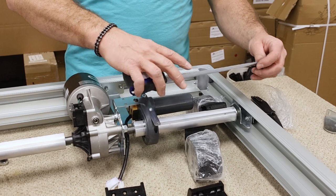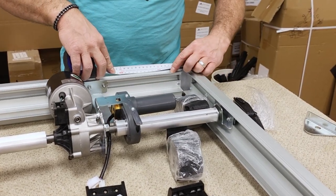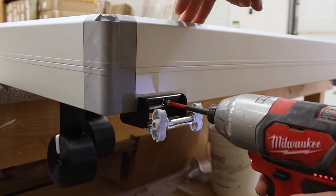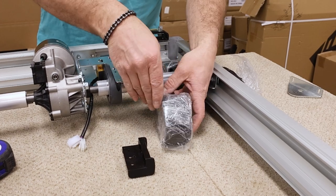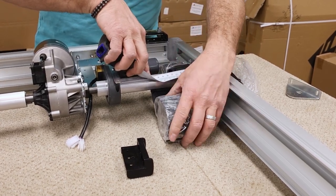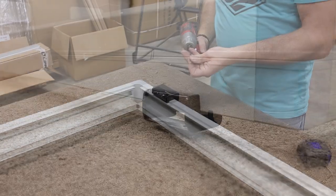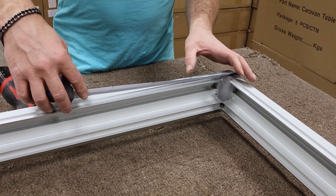In our case, we positioned our straps as close to the sides of the bed as possible so that they are less intrusive while inside the van. With your straps in position, measure from the edge of your bed to the center of the outside strap. Then use that measurement to position your stabilizer bracket onto the edge of the bed closest to the motor. Install the guide bracket onto that position using a long Phillips head screw in the top and a short Phillips head screw on the back. Repeat this process on the other end of the bed for the other outside strap. Now we will install the two remaining belt brackets. Grab your measuring tape and measure the distance from the edge of the bed to the center of the inner strap. Now go to the opposite end of the bed and translate that measurement onto the bed frame. Install the belt bracket in that position using two Phillips head screws. Repeat this process for the remaining strap and bracket.